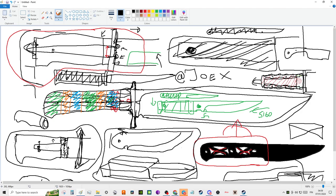So often what happens is you'll see if you put two pins there, this is when you get your splitting, not when you have one. So if you have one pin, you don't necessarily get your splitting, but when you have two, you do, because this pin wants to go up, this pin wants to go down, and they start to pull the wood apart from each other, and then your split starts here, and then it's going to want to go forwards and into there. So that's something to consider when you're doing these, right?